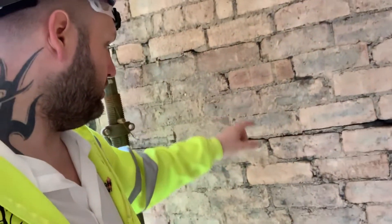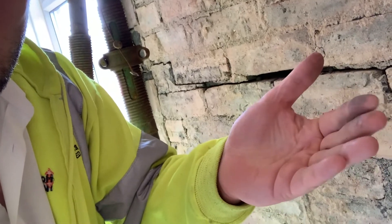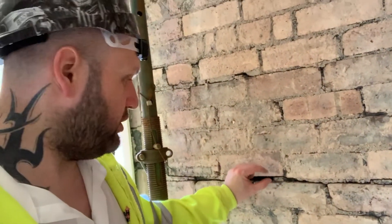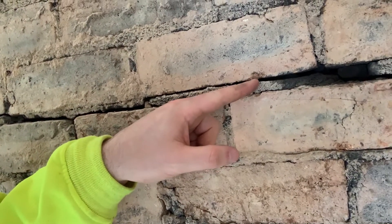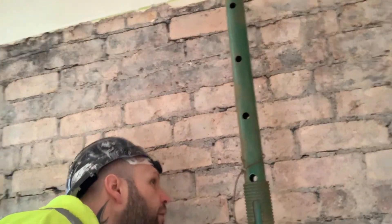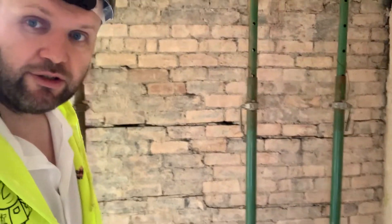This is old ash mortar, so if you look at it, it's black. I can virtually pull it apart with my fingers — it just looks like charcoal. What happens is it rusts, it expands, and then it breaks away. Look closely: can you see the gap underneath? All the way along here the cement is no longer sticking to the brick, and I can physically feel that moving.